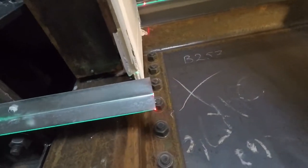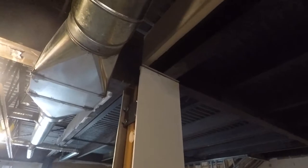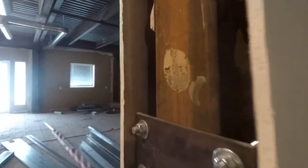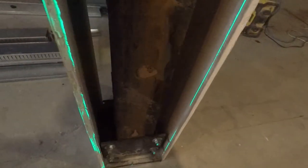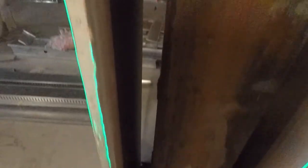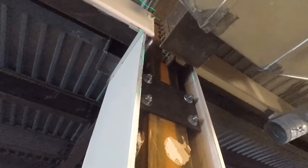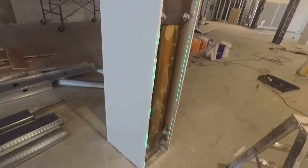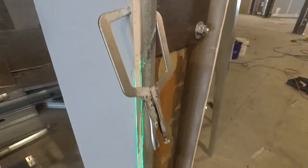I have a pin laser and a line laser working together. I'm shooting the angle to the beams, to the steel that I have access to, and I'm plumbing it all up. Look at that — I got the first two sheets on. It's gorgeous. Look how tight that is. It's the smallest possible column you could have in this situation, and that's the way it should always be. You want the tightest columns always.